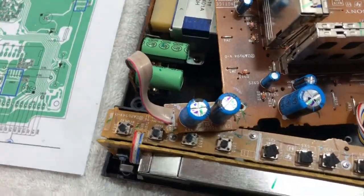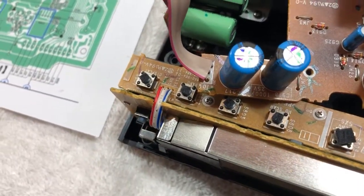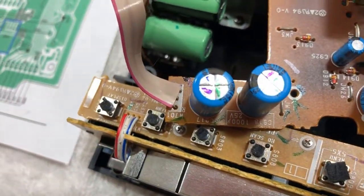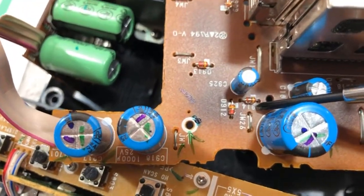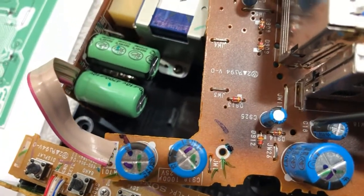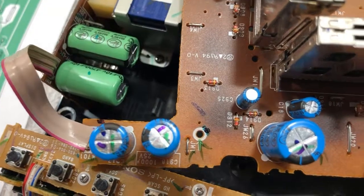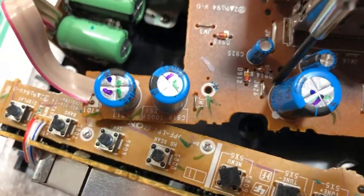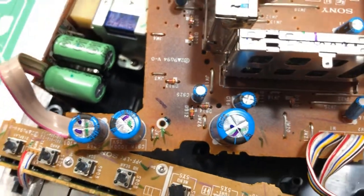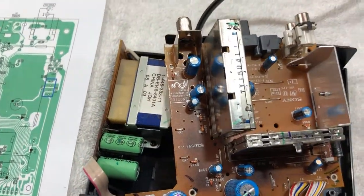For the super cap, we need to come down here to diode D914 — I find it right there. We're going to come from one side of that to our 47 ohm resistor, and then on to the positive side of the super cap. The negative side of the super cap will go to ground, which happens to be this jumper here. JW11 is a ground point. So let's move the cameras around a little bit, get the soldering iron heated up, and wire this stuff in.